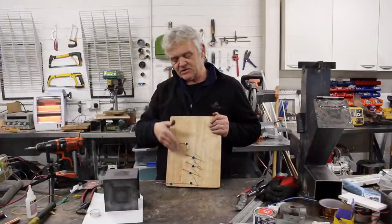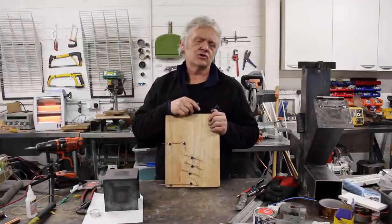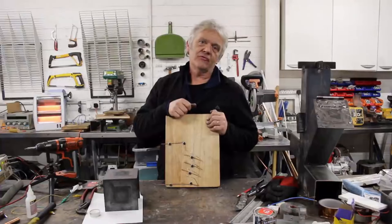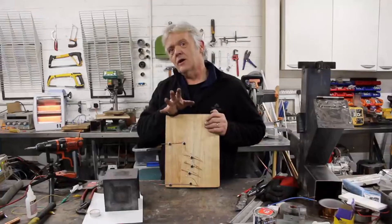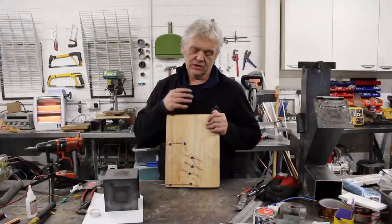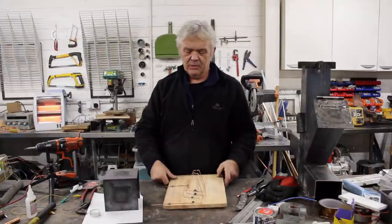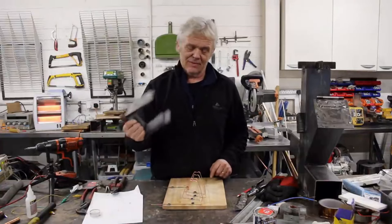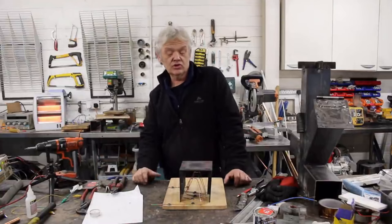I've made this out of copper — copper isn't the best but will do fine for demonstration. If you're thinking about doing this in a real environment, you'd probably want tungsten or nichrome. Nichrome is really easy to get — it's the stuff used for kiln wire, so kiln wire will last really well; copper not so much. All we have to do now is take our magnetic shell that we made earlier, drop it over the top, and that's our MHD generator done.